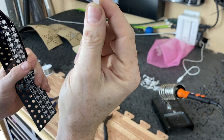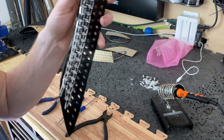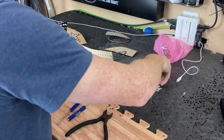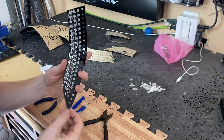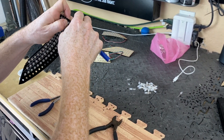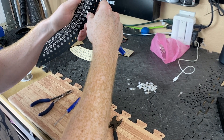The flat spot on the LED is data in. So we need data in to go next to the data out of the row before it — just like that. We're going to fill in the entire row. After I put all the LEDs in, I use a pocket screwdriver to push them flush with the plastic, as flush as I can get them. Some of the holes are a little tight, so if you push too hard you could crack the plastic.